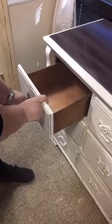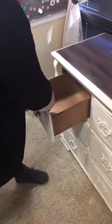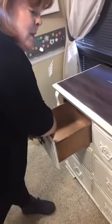The sandpaper answer is: the grit we use is 80 grit. Now, if you are working on a project where you want to bring a color through - say, have a base color like blue and then distress it to have linen come through - what you want to do is put your first coat on, leave that overnight so it really gets time to grab. Then the next day, paint your second coat but back off to like 220 grit so you don't go all the way down to the bottom and you do pull through that second color.